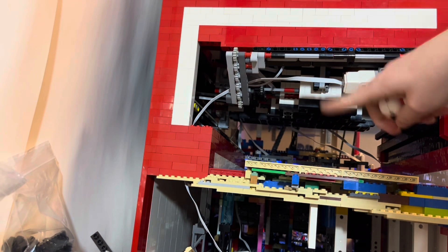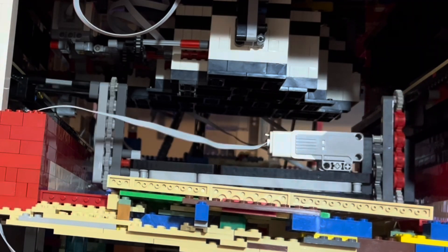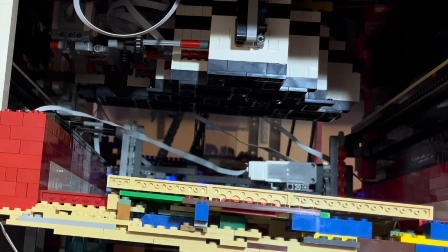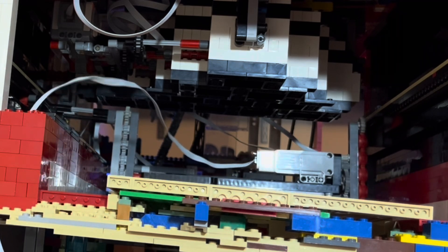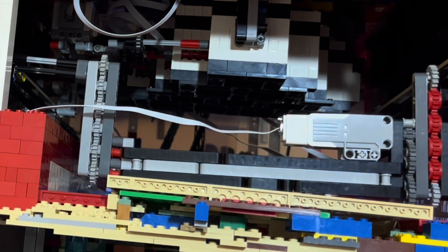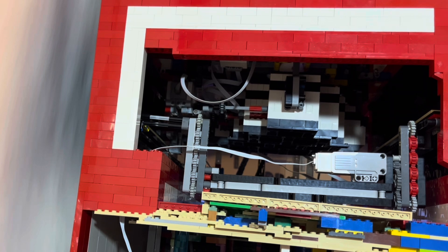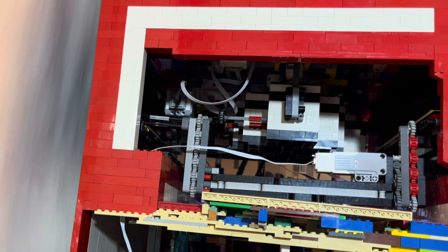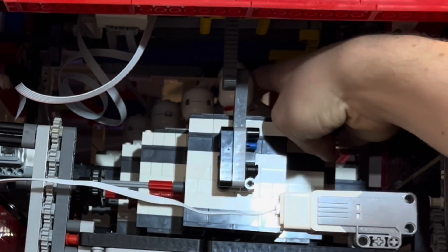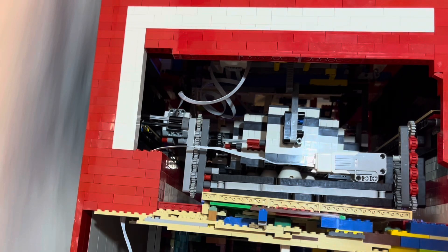When I put this pin in, it should be able to drop them and set them down. I just deposited that pin, and now the pin sweep is going to go back and clear the lane, and then come back forth. It'll drop the pins into the carriage, and then the carriage will go down and release the pins. I sped this clip up a bit, just so we could get to the point where the pin does not actually go through the carriage. I had to kind of help it there, so let's fix that.